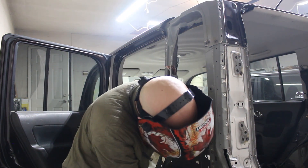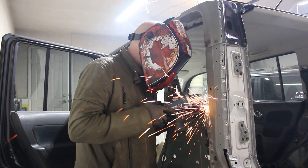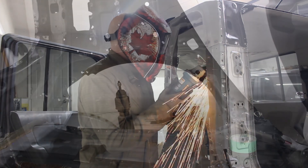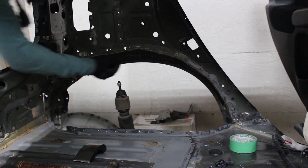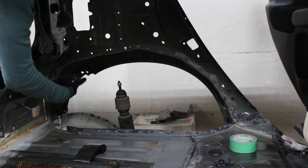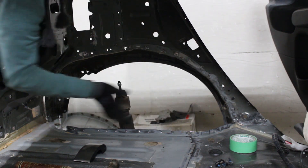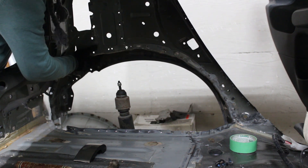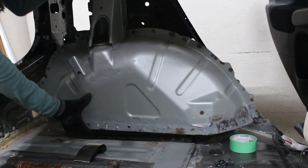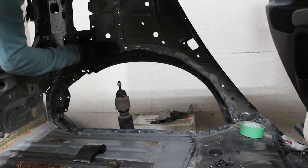I'm flushing off some of my spot welds even though they won't be seen — it's nice that everything's smooth. So what I've got to do now is flatten this and flatten these bits here where I ground out the old spot welds, because this was all bedding. And it's in view of putting the new — well, pre-used but new to me — wheel arch in here so that it sits flush. It's just this back where it needs to be and all lines through. This is going to go there, so I have to make sure that this is all flat.